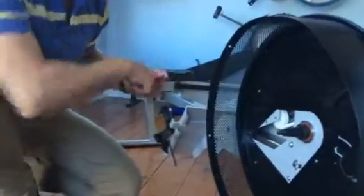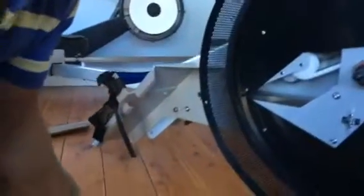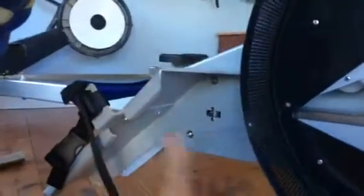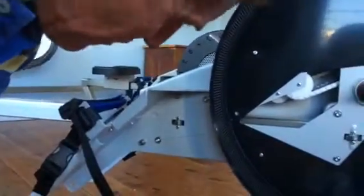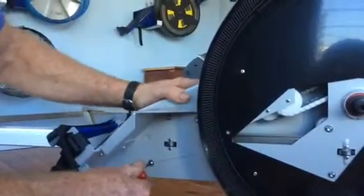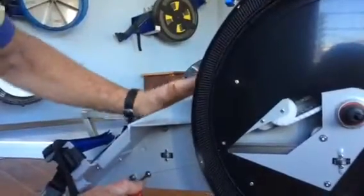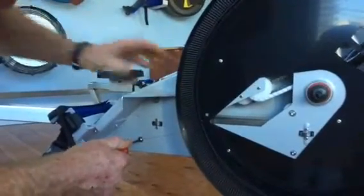Then to do that at this end, the one crucial trick to remember is that you need two 10mm spanners. You'd undo the bolts, not undo totally, but just loosen the nuts that are holding the foot plates, because they act as an extra clamp on the frame. So undo those first, and then do the exact same thing where we adjust. And in this case, we've got that movement here. So we just tighten this lower one, and I'll feel that come down, beautiful. And now I've lost that, there's no bump. There's no movement allowable.